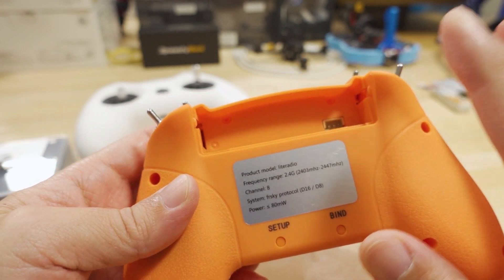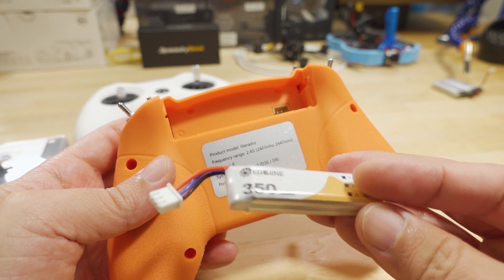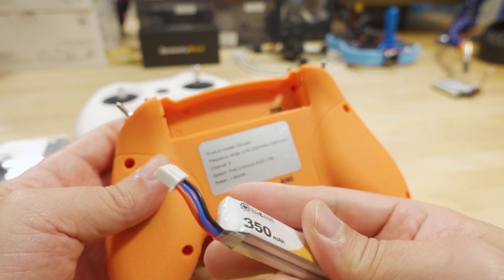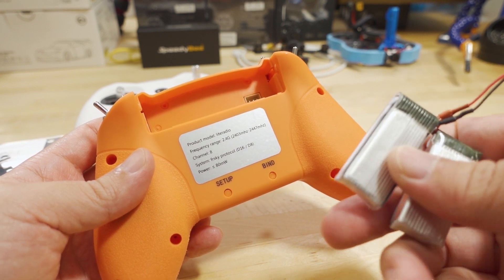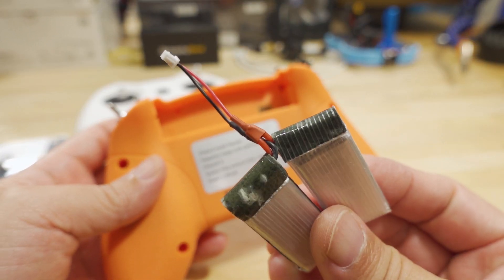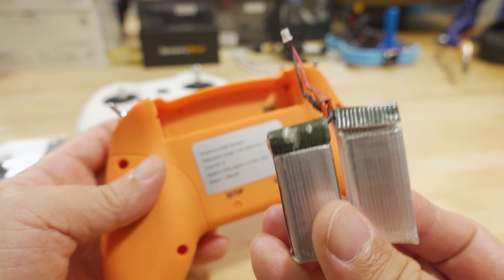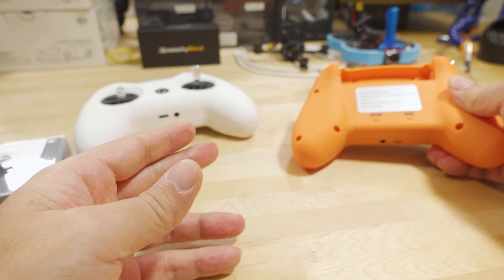The old board has the plug for the 2S battery, which is going to get swapped out, so you'll need to source a 1S battery. The battery in here is a 2S battery, but you could convert it to 1S by rewiring the two cells in parallel instead of series. I wired two 1S batteries in parallel here — the connector you need is a PH 1.25mm connector. I was going to use two 500mAh cells but I went on a bit of a tangent.